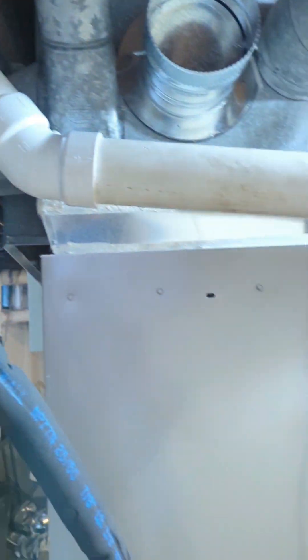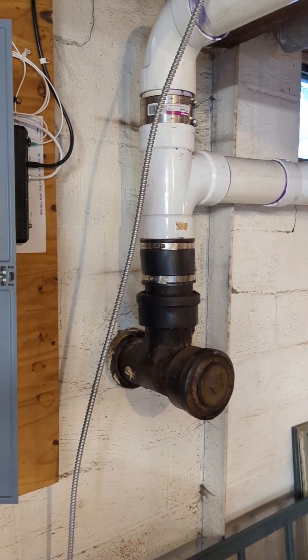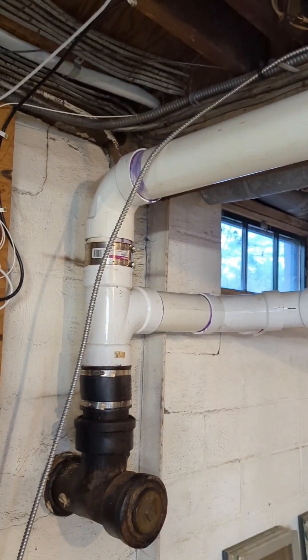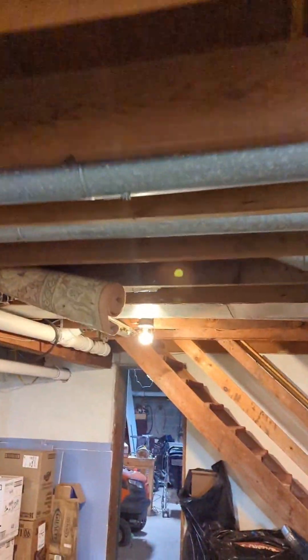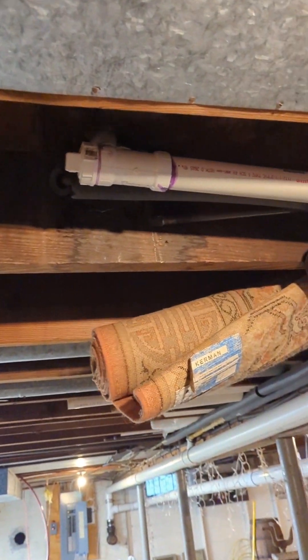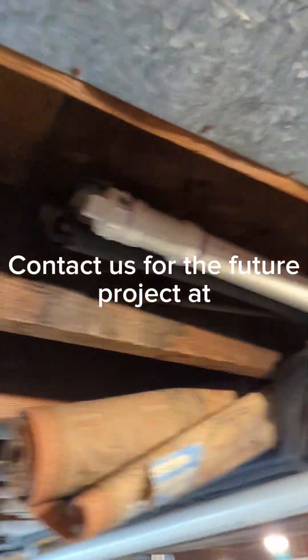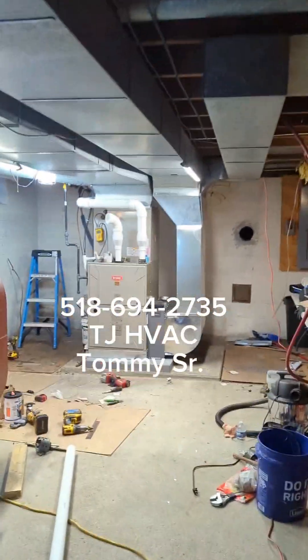Here's what we have so far — we need to put more straps in it and get that in for the drain. I might go over here and put a tee somewhere, or cut it with a slip coupling over there. Better off just going over here, connecting with an inch and a half male adapter — like a P-trap setup — and having a tee for the clean out, then going all the way over there. Should be good.